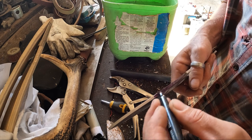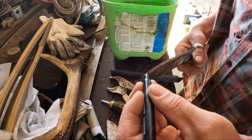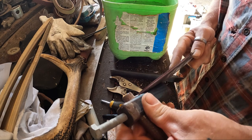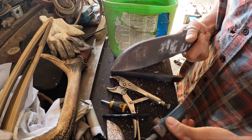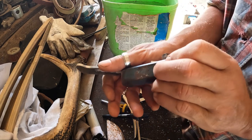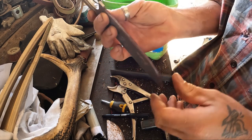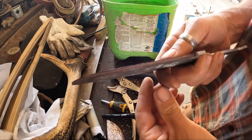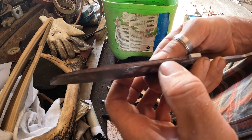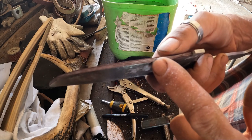I just mark a line in the middle of the steel. I've got a black texta — draw it in black and then scribe a line down the middle. When I grind it, I grind it to the middle on both sides, almost to the middle. I leave about half a mil thickness in the middle and I'll do the rest when it's hardened. I've got two scribe lines there and a bit of meat in the middle, and I just grind down to that.